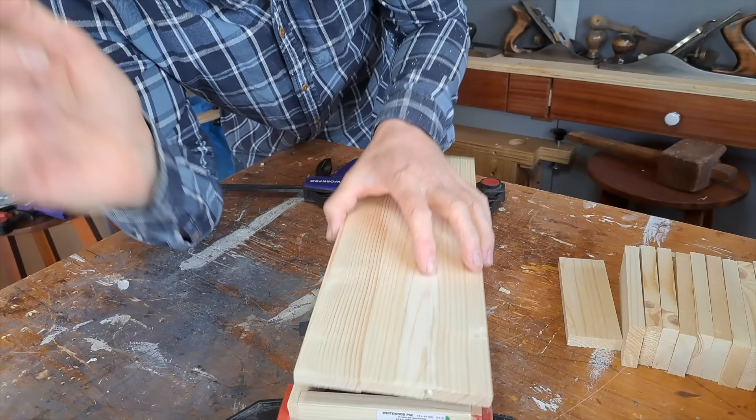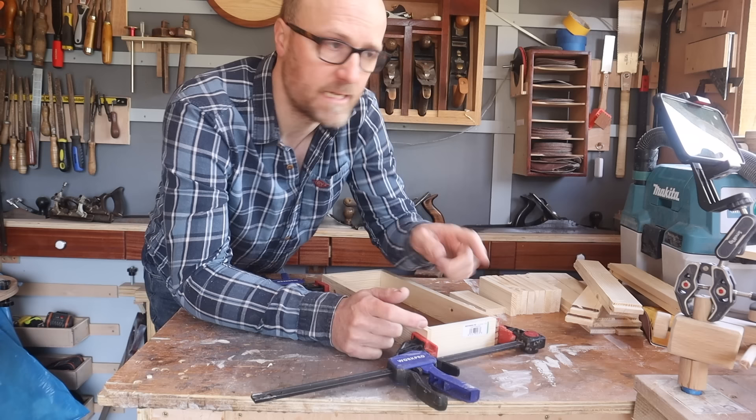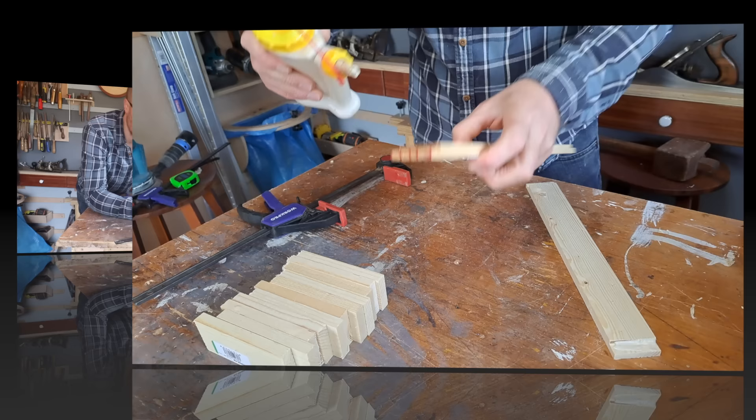This is why we do a dry fit. Check your tops against the bottom as well, because mine — I've got a little bit of the side sticking out by about two to three mil. Really simple fix: all you've got to do is take these inner pieces and just skim off the distance that's different. Don't worry — these things happen in a build. I'm not going to hide my mistakes, that is just me measuring wrong. Probably adding up wrong as well.